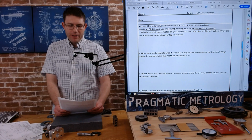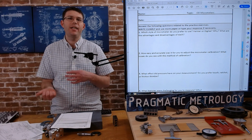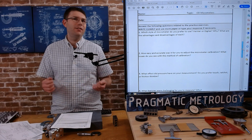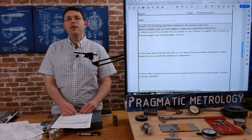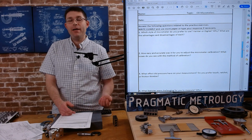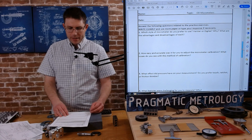Number 2, how easy and accurate was it for you to adjust the micrometer calibration? What issues do you see? I didn't need to calibrate anything for this video. You can watch the other video where you saw me kind of chasing my tail. It's a difficult procedure in terms of you can kind of develop a feel over time if you do it a lot. I don't do it every day. Calibrate a micrometer typically every 90 days, and hopefully you don't have to change anything because that means it's been in good condition the whole time. So it's always a challenge.